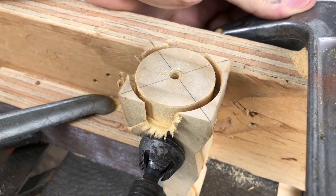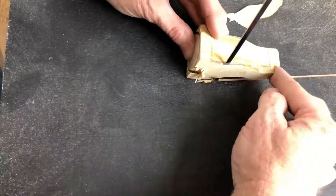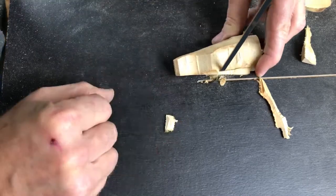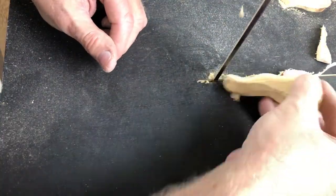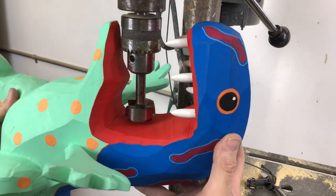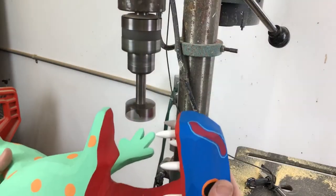The tenon machined really well. Now we can consider carving this block. Always machine before you carve — machine first, carve later. This is one of those situations I was talking about: it's always better to machine something before you carve it than to try to machine a carving. I've got to drill this hole down in the mouth, and obviously if this were still an uncarved block I could clamp it up and machine it without any problems. Oh well, let's find out — here we go.